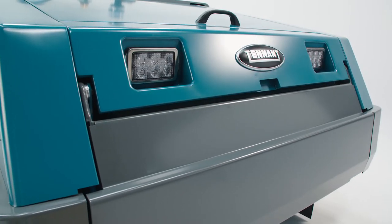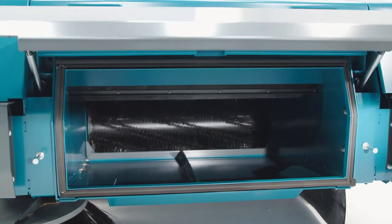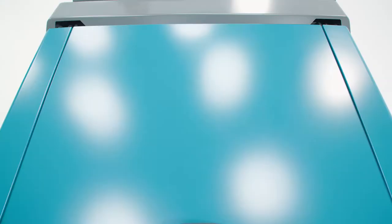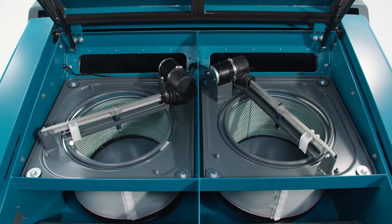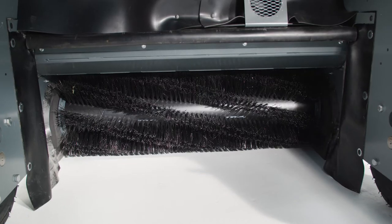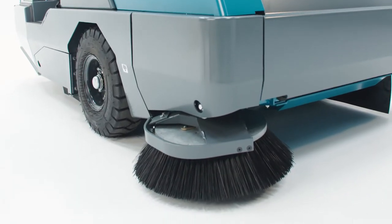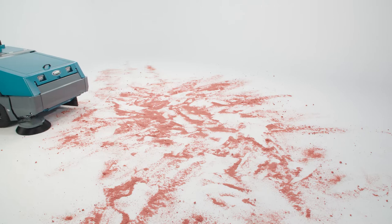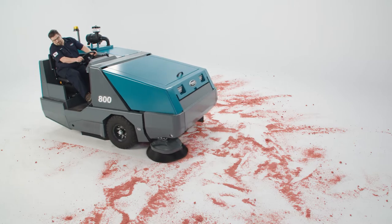Let me tell you a little bit about how this sweeper works. The Direct Throw Sweeper technology uses a one-piece main brush to throw dirt and debris forward into the hopper. The multi-stage filter system with available HEPA filtration ensures everything down to the minute particles will be captured. The 800 is equipped standard with a 50-inch main sweep brush and a right single side brush, increasing the overall sweep path to 66 inches. With the optional additional left side brush, the sweep path expands to 82 inches.